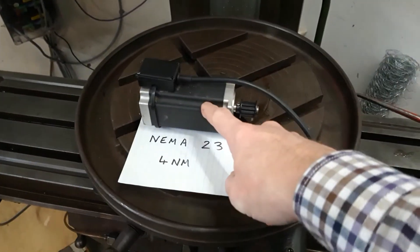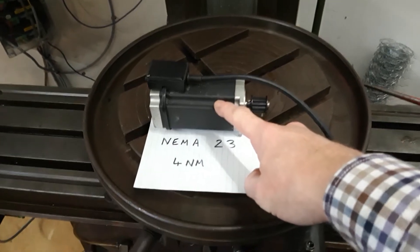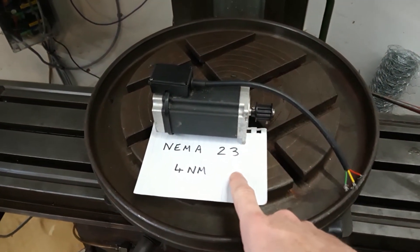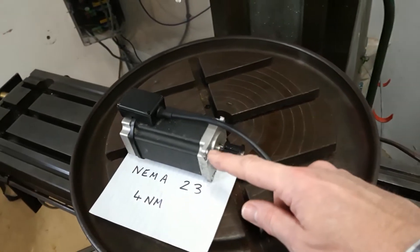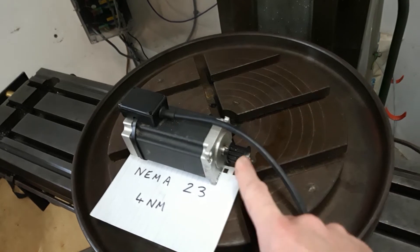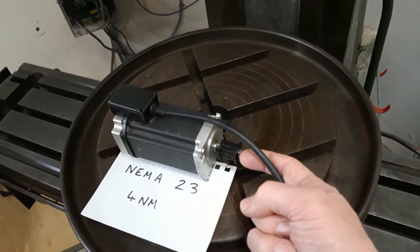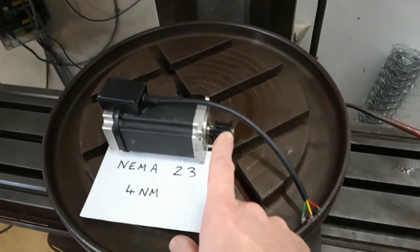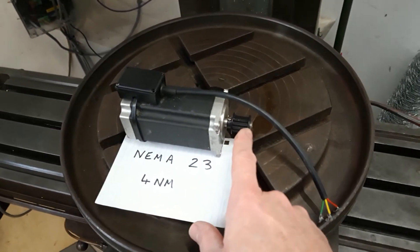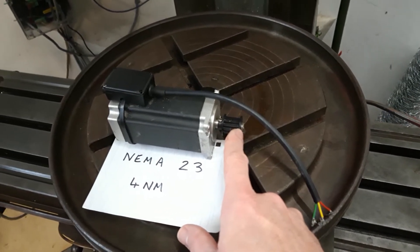So that's one of the motors that I've used. I've used 3 in total, one for each of the XYZ axis, and they are NEMA 23 motors. NEMA 23 is a standard — it tells you the pitch circle diameter of the 4 mounting holes and the diameter of the boss in the centre. Unfortunately there isn't a standard for the spindle; they come in different lengths and different diameters. So you'll have to be careful that the pulley you buy will fit on the spindle and the spindle is not wider than the pulley.